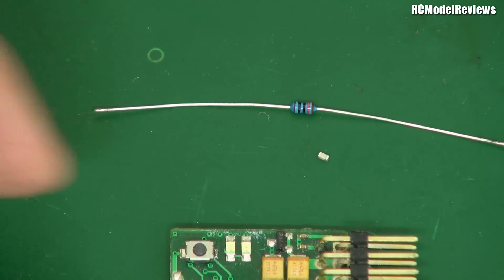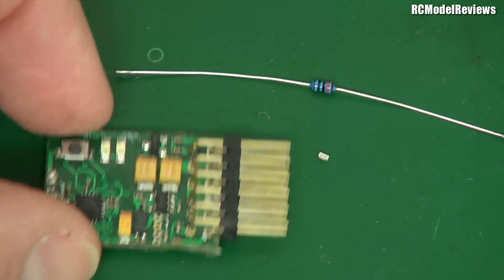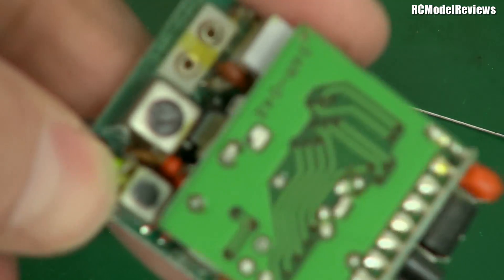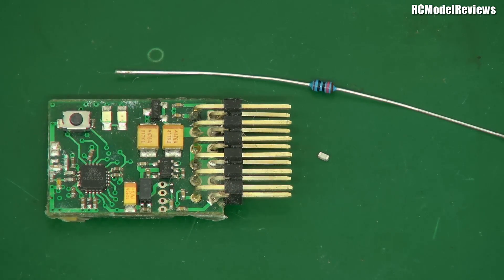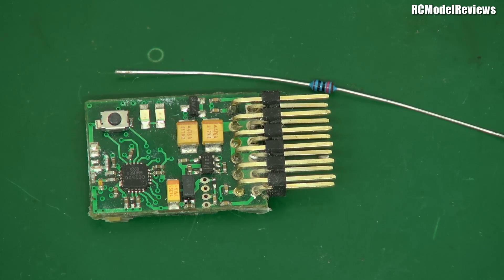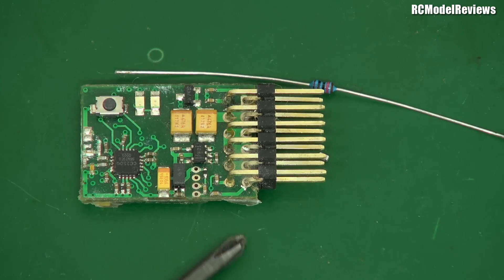The coils don't need to be adjustable anymore because with digital circuitry, everything can be adjusted with software. The frequency is set with software because we're doing frequency hopping with 2.4 GHz — the software just changes the tuned frequency the receiver is listening to many times a second, hopping across the band and listening to the transmitter, which is also hopping. We don't want to have to retune coils or change crystals to do that. It's all done in software using things called phase-locked loops and voltage-controlled oscillators. Basically, it's magic.